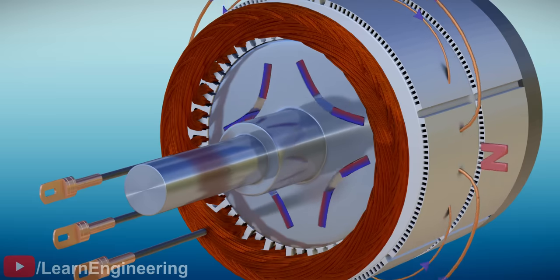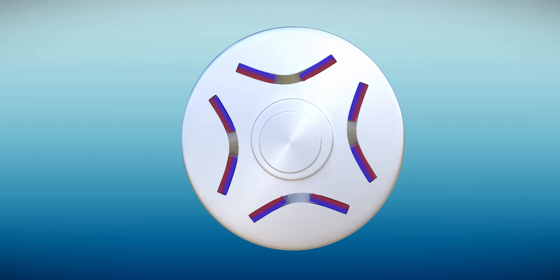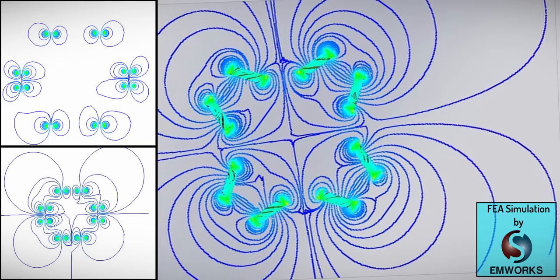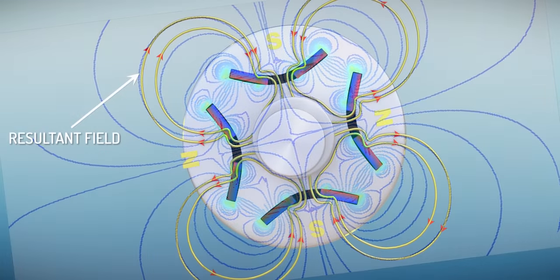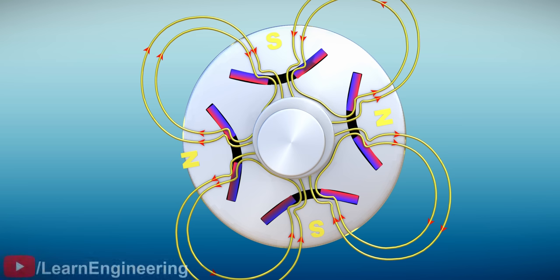This design is the internal permanent magnet synchronous reluctance motor, or the Tesla Model 3 motor. The relative permeability of the magnets is almost the same as that of air, so they will oppose the field from passing through, just as the air did earlier, thereby generating the reluctance torque. To analyze this motor properly, we first need to observe the resultant magnetic field that the permanent magnet arrangement produces. The FEA software EMWorks 2D paired with SolidWorks comes to the rescue. The resultant magnetic field produced by this arrangement is shown, and if these magnets were placed far apart, each magnet would create its own magnetic field.